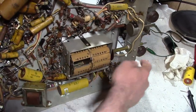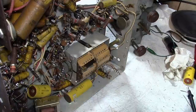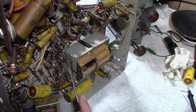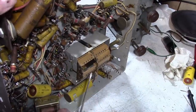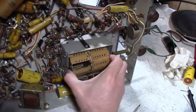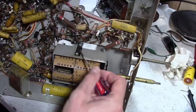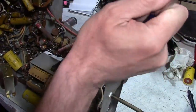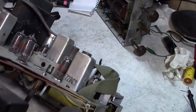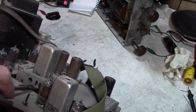So that inner shaft comes through all the way down to this end, and there's just this piece of spring steel hooked over an end here. And if we pop that out, it's almost freed up, and then we're going to deal with this guy here, which is a really stiff piece of spring steel and a screw and a roller. Can we get at that screw from the top? Yes, we can. Excellent. Otherwise, we can apply a better pressure and pop it out, but this makes things a little bit easier. Let's get this tube out of the way.